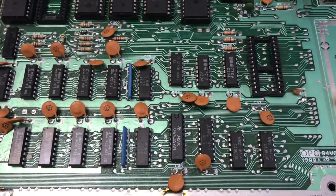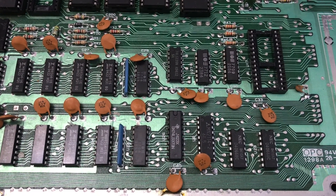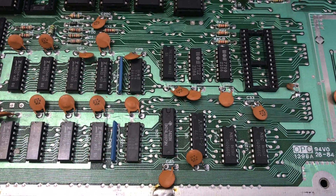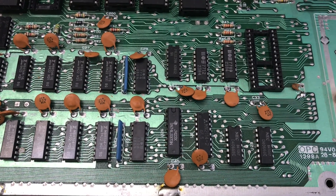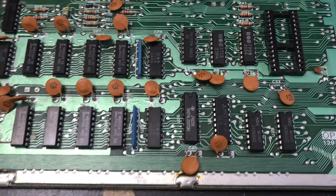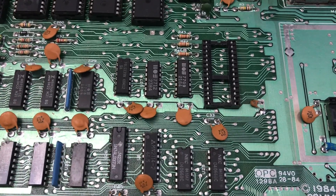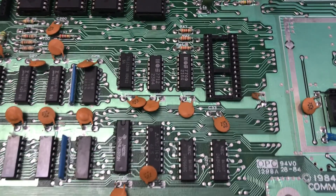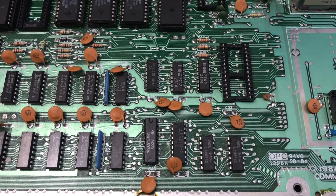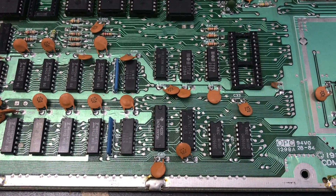We have some Fairchild or Fujitsu memory chips, but these small MOS logic chips right here throw up an immediate red flag. Anybody who's done work on Commodore motherboards knows these MOS logic chips have terrible track records. The memory multiplexers U25 and U13 very often fail, and quite often one or more of these others fail as well. Whenever I find these small MOS logic chips in a Commodore 64 board I pretty much universally replace them — their track record is just that bad.